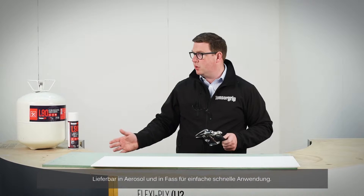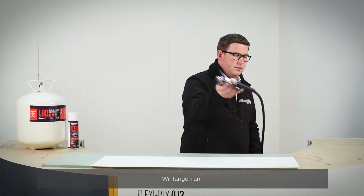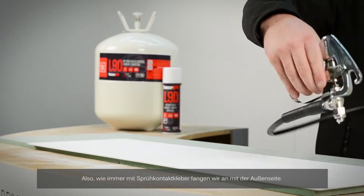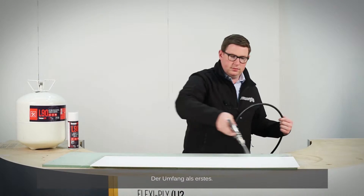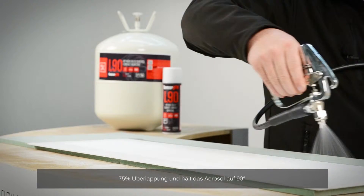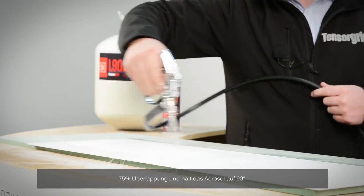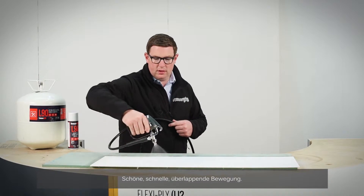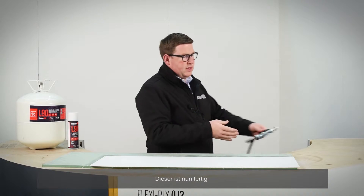Available also in an aerosol can and a canister for ease of use. As we always do with contact adhesive, spray from the outside and perimeter bond it first. Once that's done, just fill in the center — 75% overlaps, 90 degrees to the work piece. Nice swift movements overlapping.